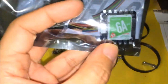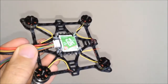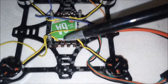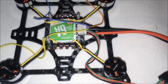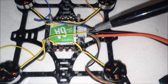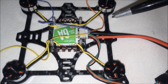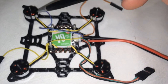The next step is to mount the ESC and flight controller. At this stage, I have the 4 motors mounted and also the 4 standoffs mounted for the ESC. This is the 4-in-1 Race Star ESC. It took me a while to solder the 4 motors to the 4-in-1 ESC here. Each motor has been soldered to the micro pads. Here you can see the orange, blue, yellow and green — these 4 colors are the signal wires to the ESC. Each color will go to your flight controller motor output, so I've arranged them so I know which motor each wire corresponds to.